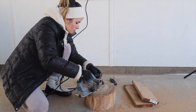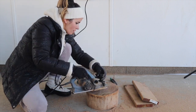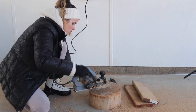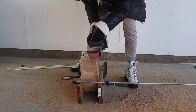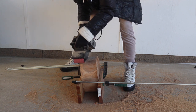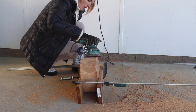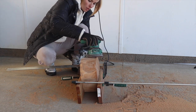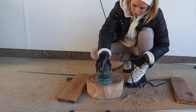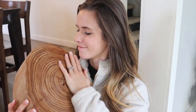Planing and sanding this wood cookie was definitely the most labor-intensive part of this DIY project, taking me just under three hours. If you want to follow along behind the scenes, you might have already seen me do this if you're following me on Instagram — follow the link in the description to come check me out on Instagram because I share my DIYs as I do them in my stories. After the planer, I used the belt sander to very quickly get everything smooth with an 80 grit, and then I came in again with my random orbital sander to get everything really buttery soft using a 120 grit and then a 220 grit. I cannot believe how the top of this wood cookie looked when I was done — the rings on the wood cookie are beautiful. I counted almost 25, so the tree must be about 25 years old. It was so smooth to the touch.